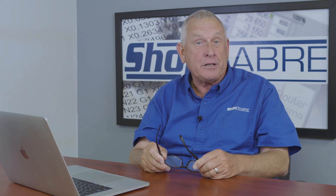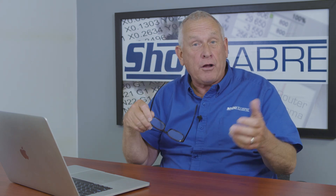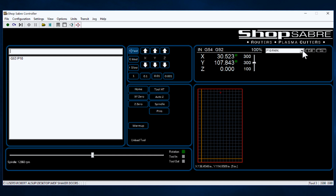Another way I use it is actually for tool change. If you don't have an automatic tool changer, you want the machine to come up to the front to allow you to do tool changes. So I'll call that 'Tool Change' and assign it to P1. I've set this to 'Tool Change,' I'll say go, and it automatically takes it to the right position. Those things just make the machine a lot easier to use.